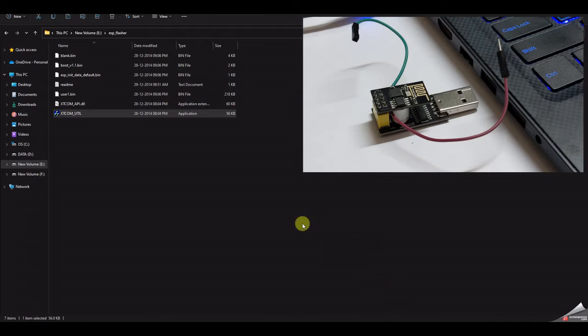You can also download AT firmware onto the board. First, download an ESP flasher — I'm using XTCommUtil software and I'll leave the download link in the description. Once you download it, you'll see a lot of .bin files; these are the firmware files we're going to flash. This is an older firmware version — the newer version is on their community page, but support for this board has been stopped, so I'm using the older version.